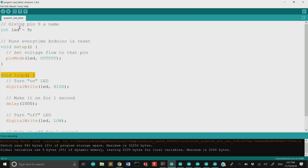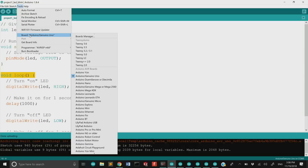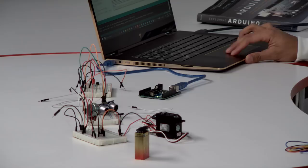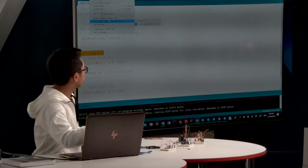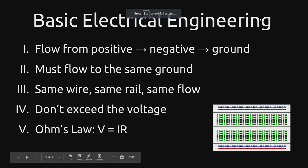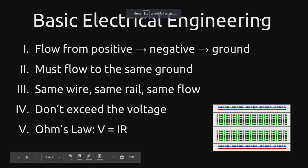We also need to be familiar with the Tools tab in the IDE. You can check out the different types of boards available — a common bug is choosing the wrong board. For today, we'll use the Arduino Uno. Also important is the port number, which makes sure commands get sent to the specific port. Once connected, you can see it's on COM5.